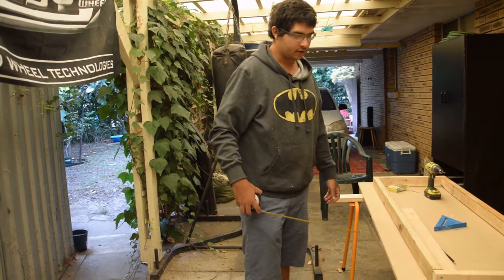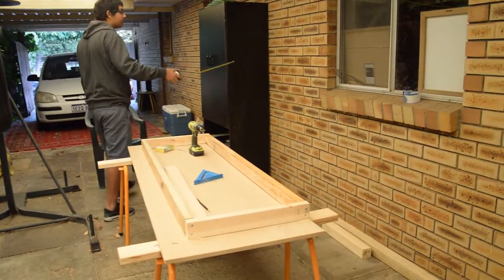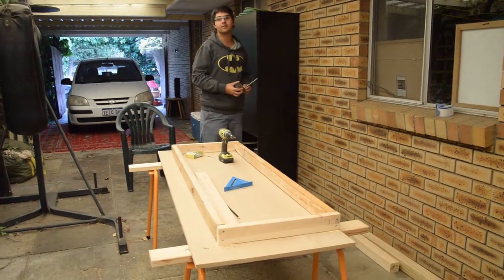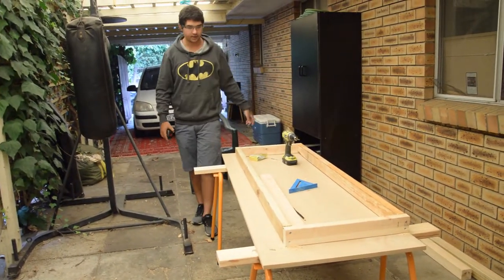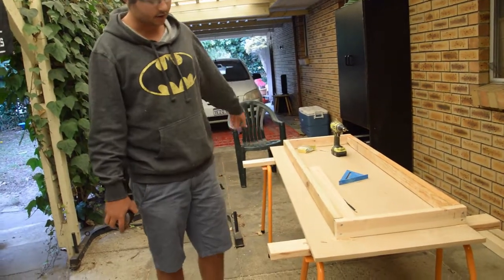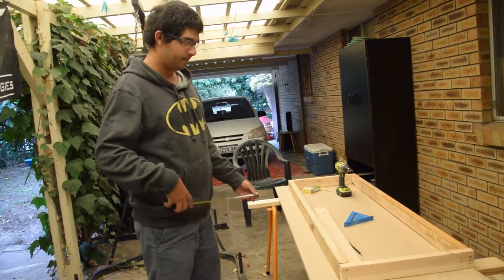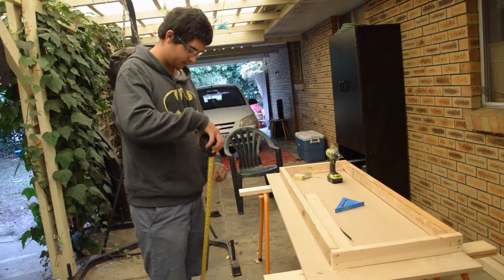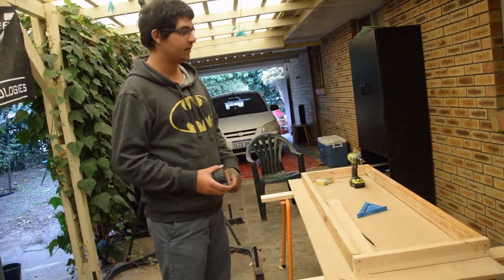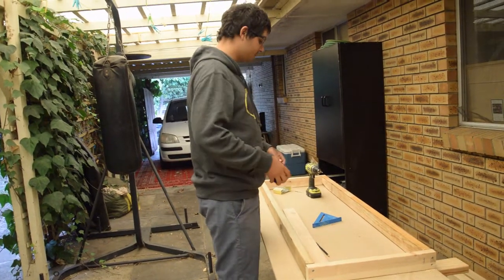The way I figured out the measurements was I wanted to go on this wall here, between the two windows. I've got about 1700mm to fit in between. I went down to my local hardware store and saw they had this MDF here, which is 1600mm long, so that will fit in there pretty nicely. I wanted it about belly button height — about 900mm for me — so that gives me a nice working area where I can stand without bending over.